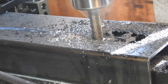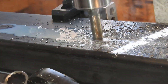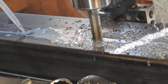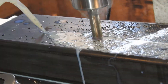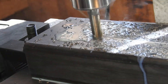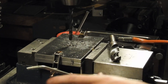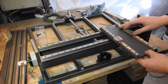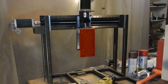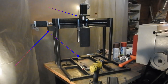Once I finished, I once again adjusted the rails to be parallel. At this point, it was mostly making different mounting plates, like these that I welded to the ends of the 2 by 4 tubing, which the x-axis ball screw mounts to, and the uprights attached to. There are also two plates for the z-axis: one that mounts to the x-axis rails and has the z-axis rails and the ball screw on the other side, and a second that mounts to the z-axis rails and has the spindle mounted to it.